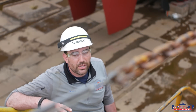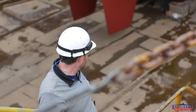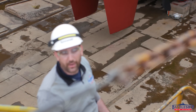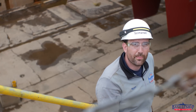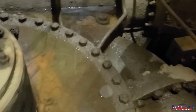From this plan, you can also see the drainage culverts. The drainage culverts are the graded areas down below — that's where the water comes up from when we're flooding the dry dock, and that's where it drains down to to get to the dewatering pumps. We've got a video about the pumps coming up soon as well. Four of these culverts go into the pump house: one from each side for water coming in and one from each side for water going out.